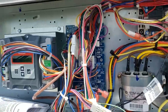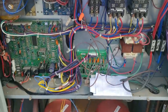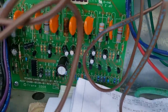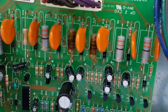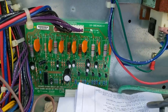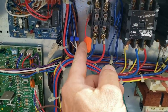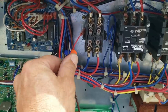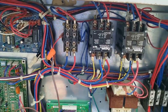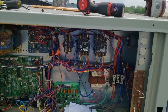Moving on to the next unit - it's not hooked up either. Look at these resistors - how burnt they are compared to the other ones. I wonder if that's what I was smelling. They're definitely power resistors. You can smell some stuff in here that doesn't smell real good. I love the way they wired the fire alarm - they're just breaking the contactor to the fan, they didn't kill the whole power to the unit. So if it ever triggers and it's calling for heat, it's just going to run that heat exchanger until it trips the limit, or the air conditioner is going to run until it freezes into a block of ice. I always like to break R at the transformer - that way, everything shuts down immediately.